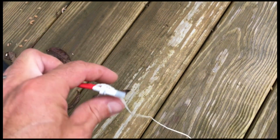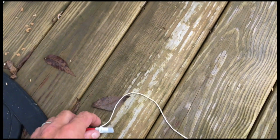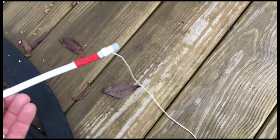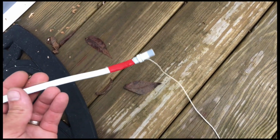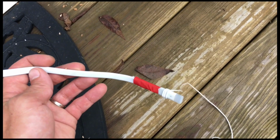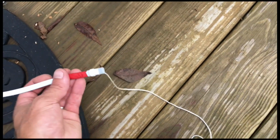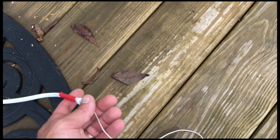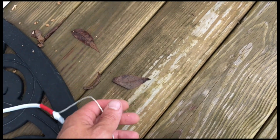So I decided to tape it, and I took the string to it. And then it kind of assisted me to get through the pipe because it is 1/2 inch PEX pipe. So it made it a lot easier to pull because you can push it in, but you get like halfway and then you need some assistance. So that's when it's good to use the string.